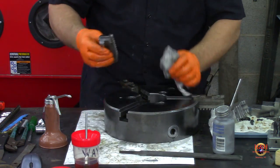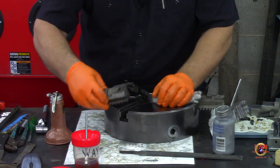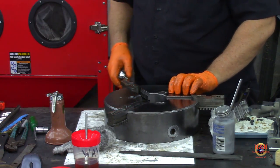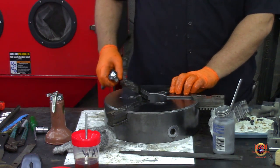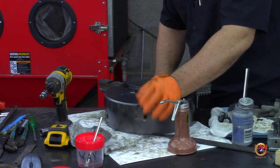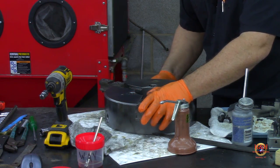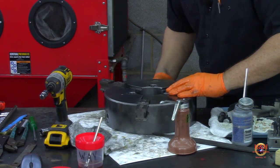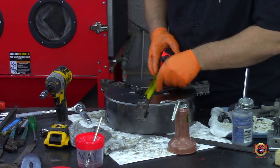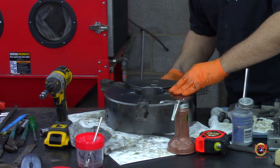There was a small burr on the end of that jaw, so we just knocked that thing down, re-coated it with some oil, and got it ready to go. I believe we get number one going first and the rest follow — that's the plan anyway. Let me get a longer extension so I don't have to drag this thing off the table. We got number one, number two, and number three in their respective places, so I'm going to push on number one — it's grabbing. Number two — grabbing. The goal is to get them all even. Quick measurement: two and a quarter, two and a quarter — yep, I think I got it right where it needs to go.